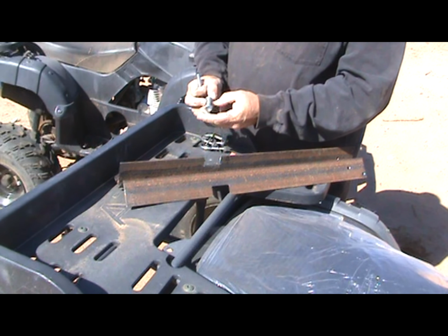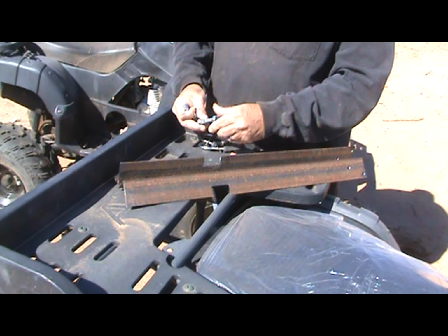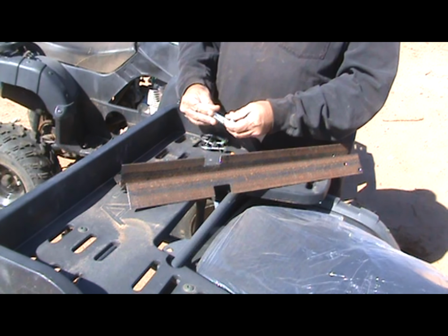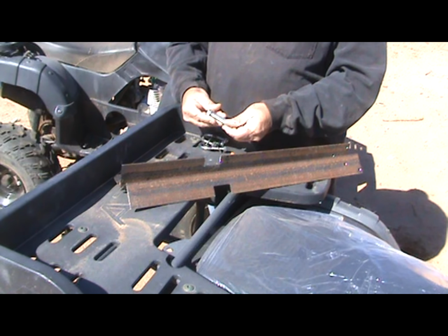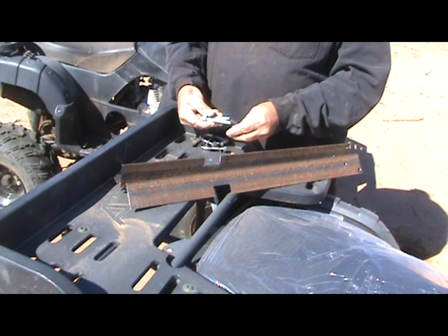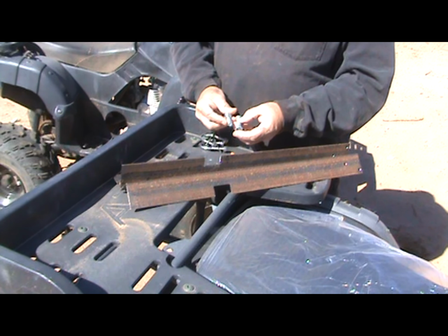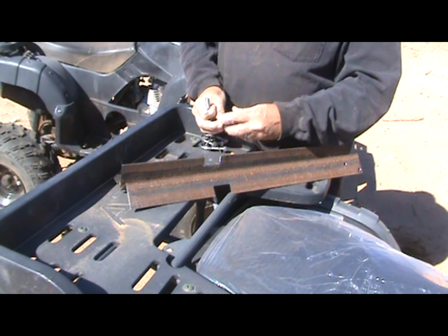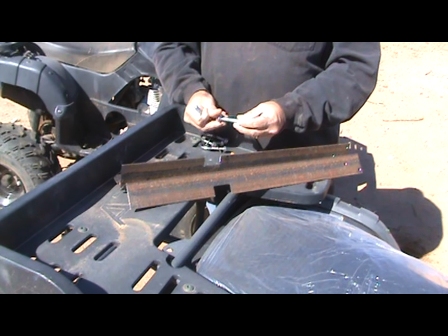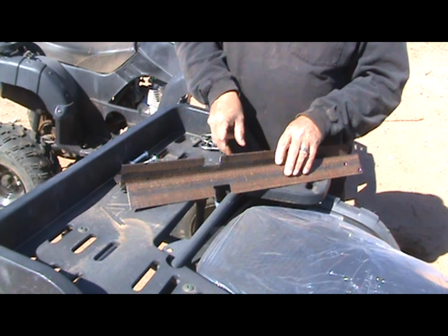This is the bolt that came out of where the housing for the bottom of the shock absorber attaches to the axle housing. The shock comes up here, okay. Now, being as I'm going to add these two pieces, what is that, an eighth of an inch? That's what, a quarter inch more? So I went ahead to Ace and got something that was about a half of an inch longer, just to make sure that I had plenty of thread to get everything lined up. It's a fine thread metric, and you have this. I used the same nylon nut that came off of it. I just matched the thread with this bolt that's a half an inch longer. So everything fits well. I tried it out.